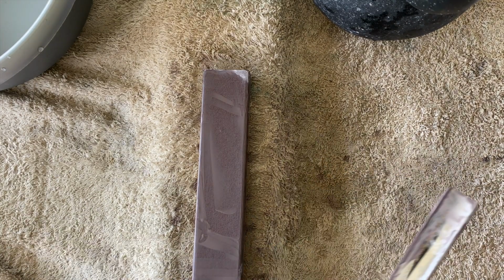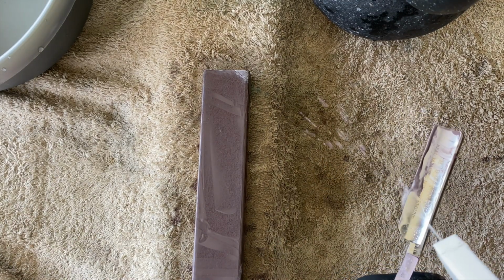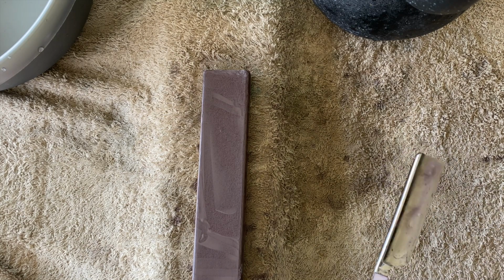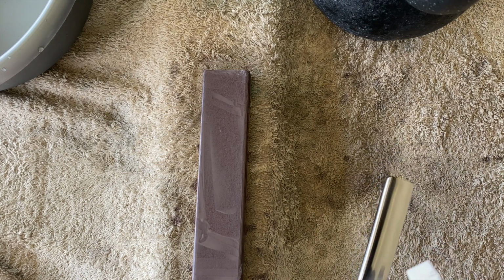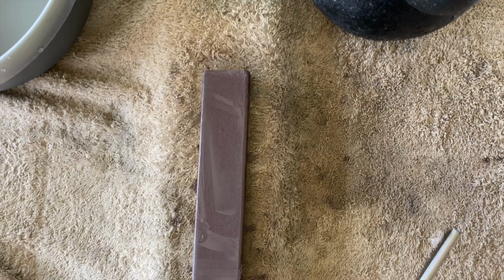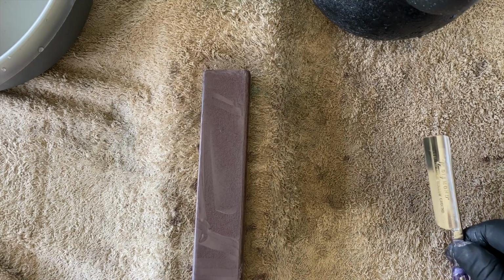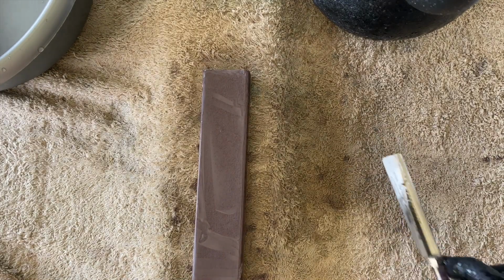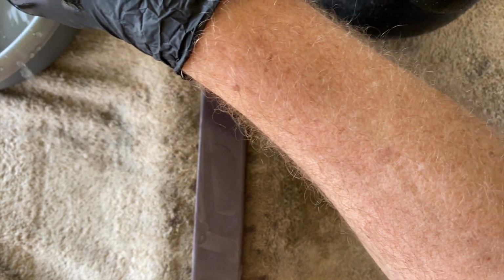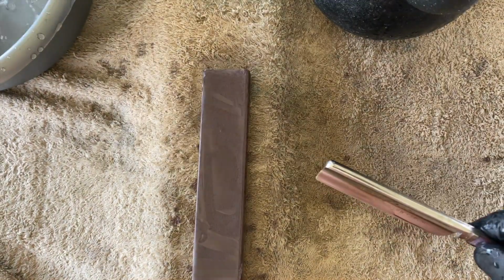So I've shown you guys the impact marks, or the rust pits remaining on the spine. Those will never polish away, so it will provide a different feel and feedback on the stone when you hone, so just keep that in mind. At this point in time, I'm really not too worried about the feedback. I just want to make sure we get a clean, nice, even bevel set.